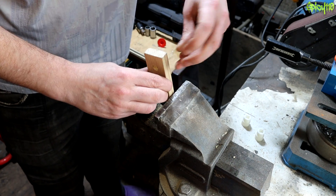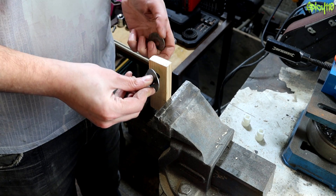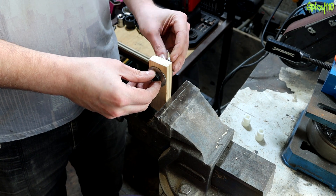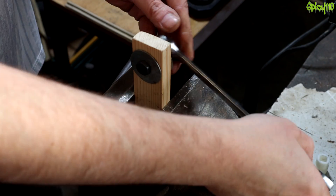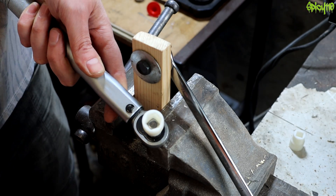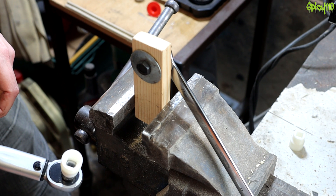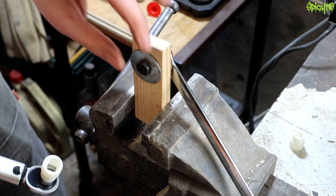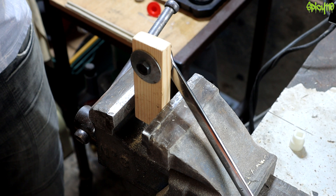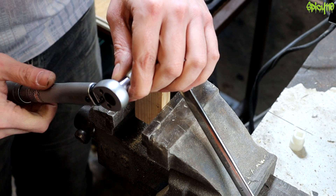I have got a piece of wood and I'm going to put that piece of wood in here, then I have a bolt with a washer that's going to go through the piece of wood, another washer on the back, and then a nut on the back of that. So I think you can see where we're going with this — put a ring spanner on this side to keep that still. As you can see, this goes on just like any normal socket. Now I'm going to progressively torque up this nut until this breaks, then find out where that was, redo it up with a metal one to the same torque or maybe a bit over, and then try to undo it with a plastic one. Honestly this is really interesting to me — I was going to do this test anyway, but then I thought: I'm a YouTuber, I should do a video on this. Okay, so we're going to start at nine newton metres.